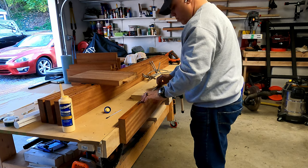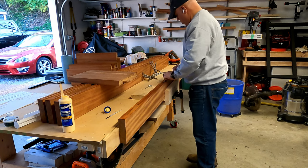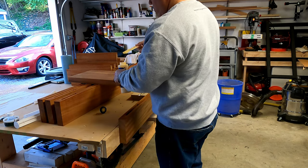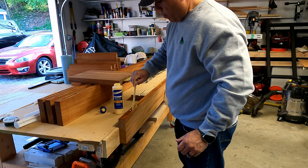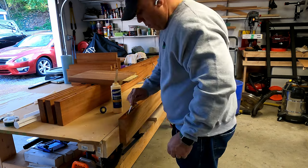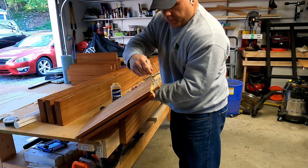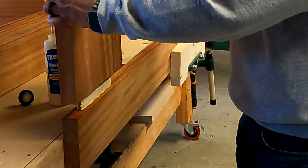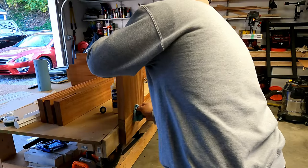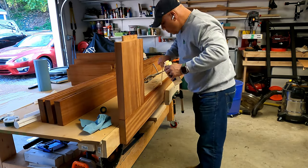The time has finally come for the final assembly. We start off by putting all of the foam padding inside of the glass grooves and then we have to go through the excruciating part of making sure that everything is glued properly. The glue was a little bit thick, but we made sure that we covered all of the surfaces that we wanted glued. We also had to avoid putting glue where the glass was going to go - we want to make sure that this glass moves freely so that as temperature and humidity changes occur, the glass and the wood do not bind up together.